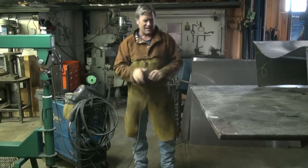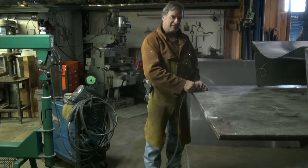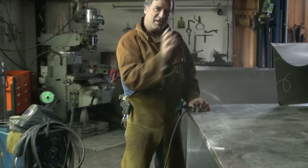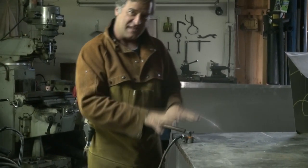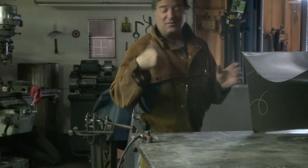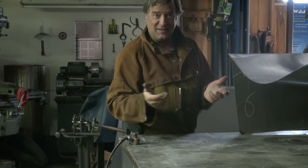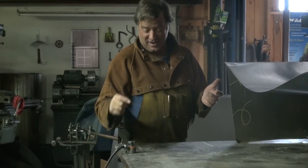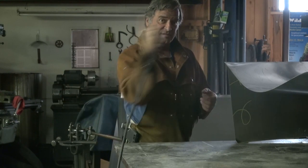What I wanted to talk about was grounds. You've got to be grounded all the time. I've got a metal table — I could just hook it right to the metal table if I had to. But it's always best to have the ground on your work instead of on your table. Because if you put it on your table and you're over here working on your piece, especially in the summer like here in Arizona and you get all hot and sweaty while you're welding, you can lean up against the table and get shocked — the current wants to go through you to ground rather than through the table back to the machine. So it's always best to have your ground on the work.